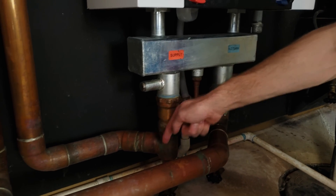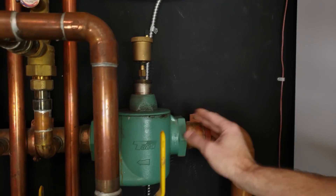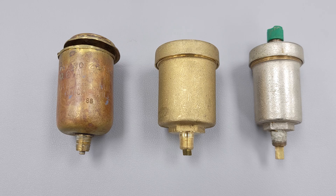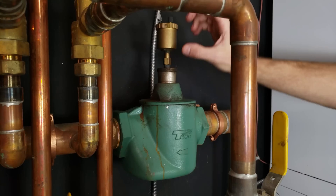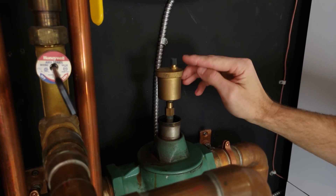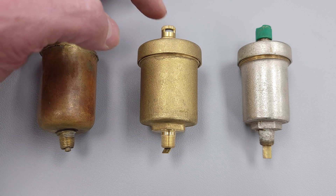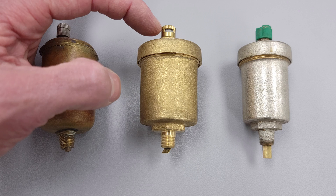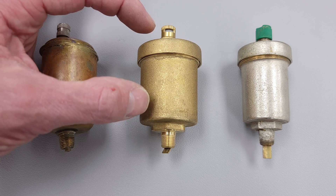There are a variety of reasons why air could be in the system. If you have something like this installed, it's supposed to be an automatic air bleed — not fully capped off and unable to function. You want to be able to service these, or in some cases replace them, so they do their job properly. In an emergency you can shut the caps down so they aren't leaking onto the boiler. If you're servicing a boiler and the cap is completely tight, either the installer or last technician didn't understand how it works. You want to loosen the cap and check if it's seeping, service it if possible, then tighten it all the way down and back it off a quarter turn to allow automatic air bleeding during operation.